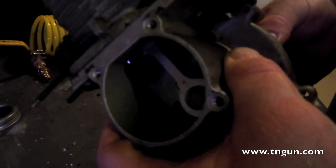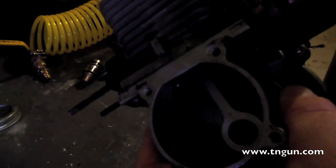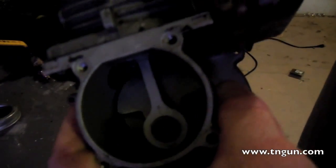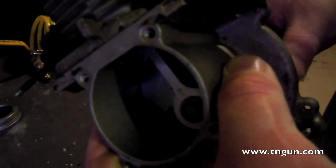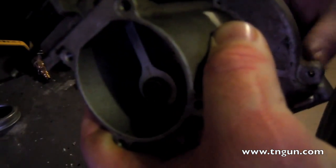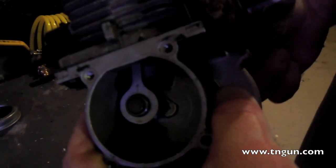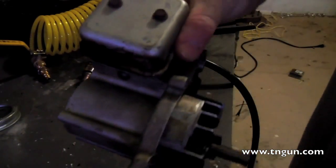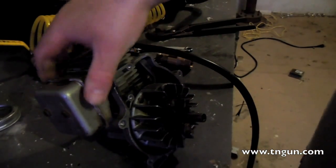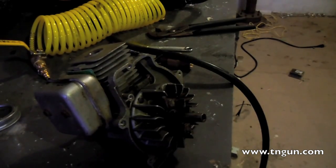There's nothing keeping it down. If there was no check valve, the air would just push it and it would lock itself down. But with the check valve, you just get a burst. As it comes down, inertia keeps it going — it wants to spin. Inertia gets it coming back up, it gets another blast, pushes it down again. That's why you have to have a flywheel — the weight starts to spin and wants to keep spinning, which keeps pushing that check rod up.